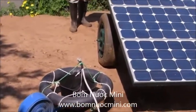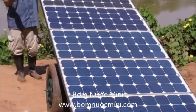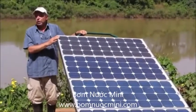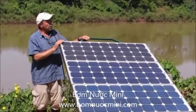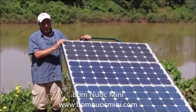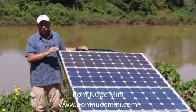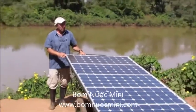That should give us an increase in output through the day of maybe 20% to 25% extra output. And also, for this pumping application, it means that the output of the pump will be more constant during the pumping hours — not completely constant, but for at least six hours of the day. As long as we can orient the panels towards the sun, we should have a fairly constant pumping rate for several hours of the day.